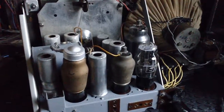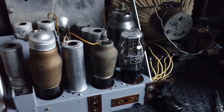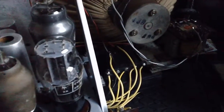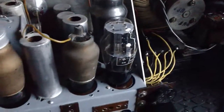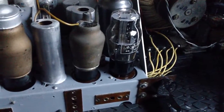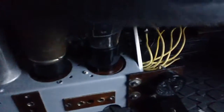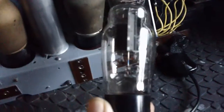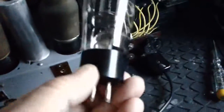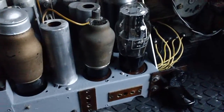We're back on the Philips 470A. I've wired everything up now. Of all the sets I've ever worked on, I've got the least confidence that this one will ever work. I bought a new rectifier which arrived this morning - that's a UU5. The rectifier it did have in it was an IW4350, same valve base obviously, but that's an indirectly heated valve, and it should have a directly heated rectifier in it.